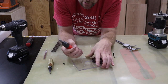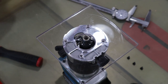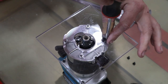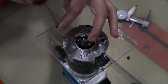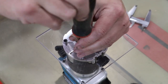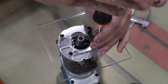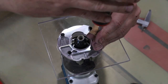I'll go ahead and get all these done and then I'll be back. Here we are — you can see the plate is on there and the holes line up. I'm just going to drop the screws in, and I'm not going to tighten them up until I have all of them in, because we want to put even pressure on them — kind of like tightening a car tire, going across diagonally. Looks like one hole over here was off a hair, but looks pretty good overall. You don't really need to crank down on these — you just have to snug them up.